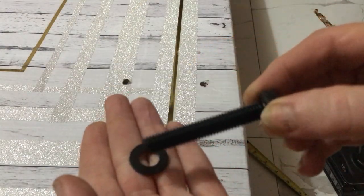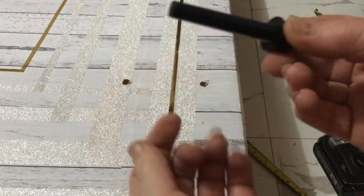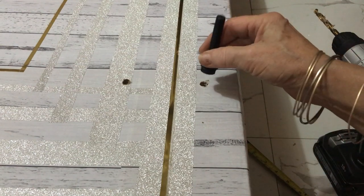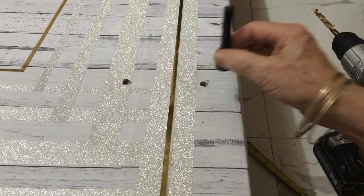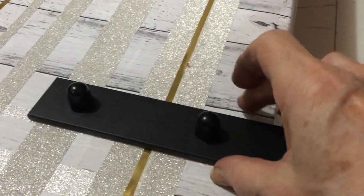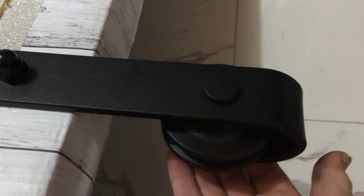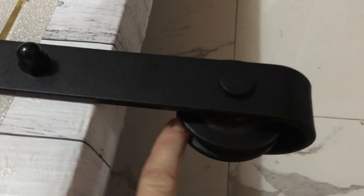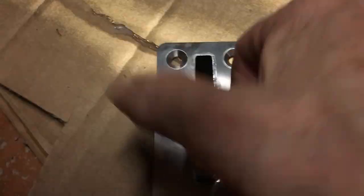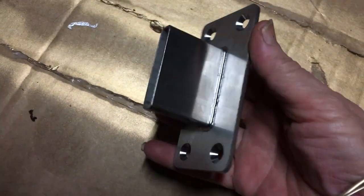When you're attaching the bolt, make sure that you've got one washer on one side and the other washer for the other side. You have to thread from underneath to get the bolt to come through the top. When putting your runner on — this is the back of my door — you need to have the runners facing so that they're curving over that way, so the rod or rail will go underneath here.